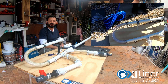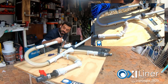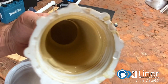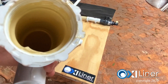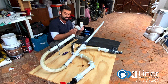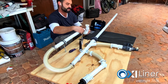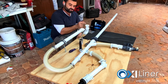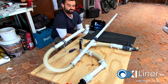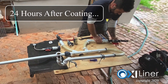You'll have your appropriate epoxy or preparation material that you'll introduce into the line, push it through and then push the liner through. I would like to demonstrate how effectively the epoxy medium is introduced into the pipe. This is what the trap looks like 24 hours later — it is amazingly smooth. The coat goes all the way through. I disconnected this when the epoxy was still wet so I could demonstrate the smoothness of the coating. This is virtually one piece. If I had not removed this we would have one sleeve from where we introduced the epoxy all the way through to the end of the line to where it hits the gully, and we virtually have one new cured sleeve with no interruptions all the way through, the day after the coating.